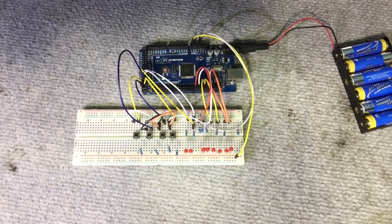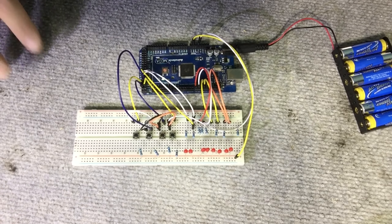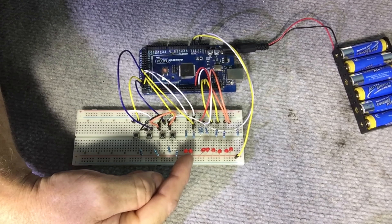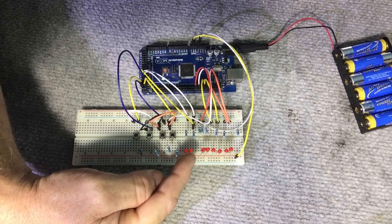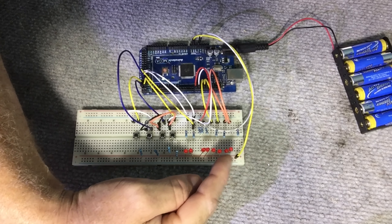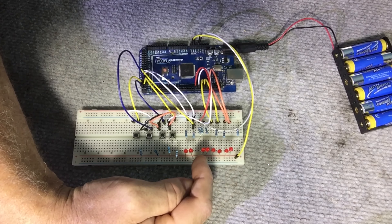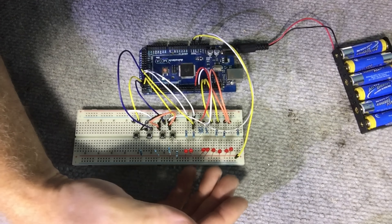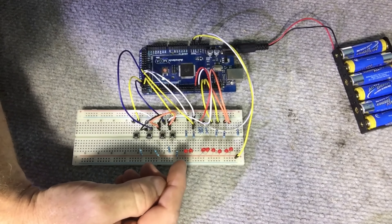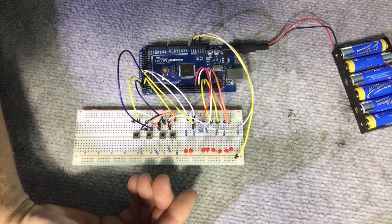On the programming side, I've basically got it sorted. I can now switch between two banks, indicated by these two LEDs here — bank one and bank two. The six other LEDs represent the relays you'll be switching, or each loop that your effects pedal will be on. All I've got to do is connect them to relays. The bank LEDs don't need to be connected to anything else — just an LED so you can visually see which bank you're in.